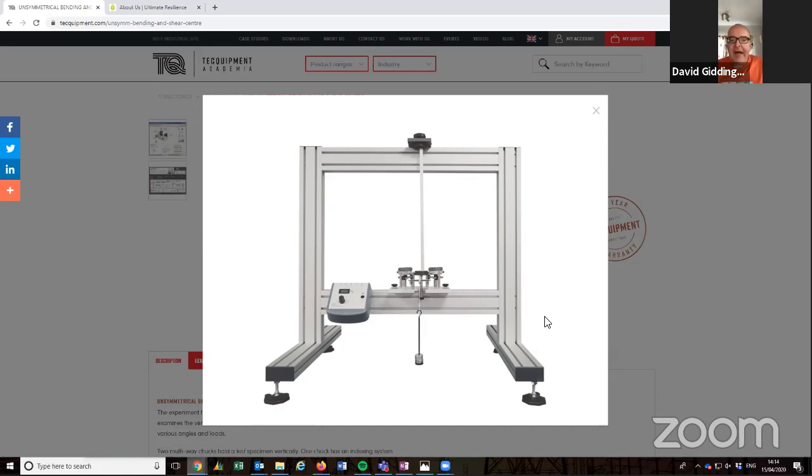The secret, though, is in the setup, like all the experiments. Make sure that the specimen beam is completely vertical and everything is locked down tight. But the problem I think Murugan is facing is the friction in the dial gauge stems. The plunger on the dial gauge is spring loaded and relies on pressure to push, and if you're not careful, it can deflect the specimen beam, which is what we don't want.